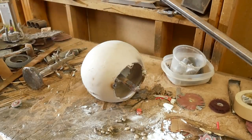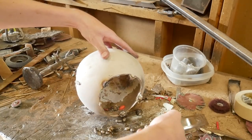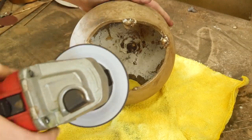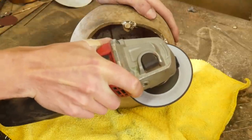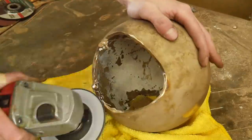What you want to be left with is the closest possible shape as your original working item — in this case a balloon — and preparation to start rebuilding. This process is recreation or more duplication. After removing a majority of the sprues, what we're left with is very close to the original wax duplicates. There's just some fine tuning and trimming left to make space and room to tightly place all of the pieces back together in the right places.